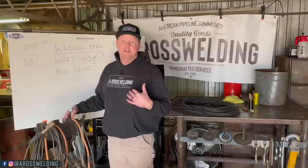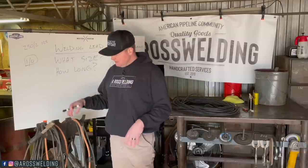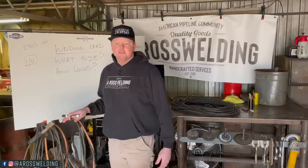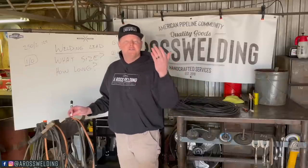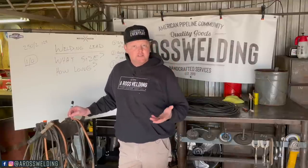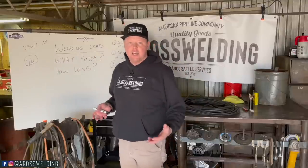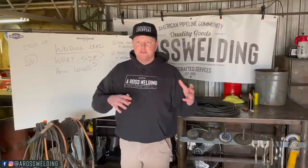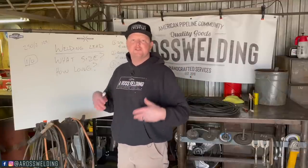I've only been welding for 15 years and I've bought several sets of leads over the years for different welding machines — two or three different sets for this welding machine — but this is probably the longest I've had a set of leads, close to nine years. It just depends on how well you take care of them and what you're doing a lot of. If you're doing a lot of welding on heavy material all day, it may not last near as long. Also, the proper size of welding lead matters — if you're welding on heavy material with too small of lead, you're going to burn up your lead a lot faster.